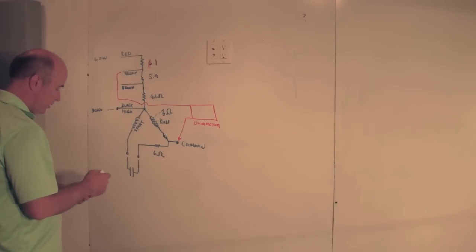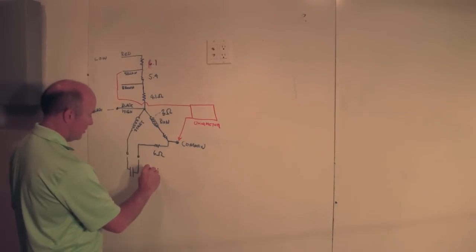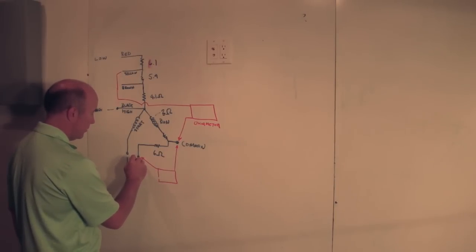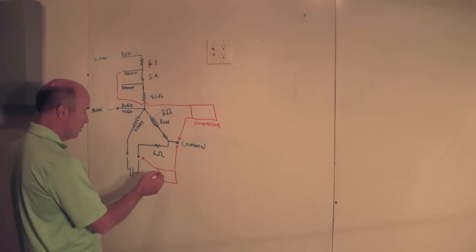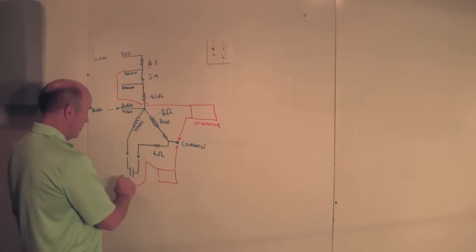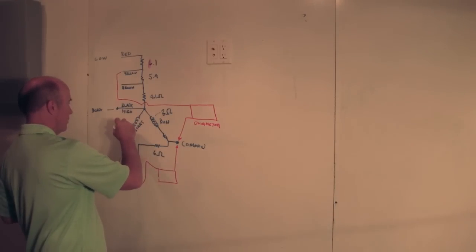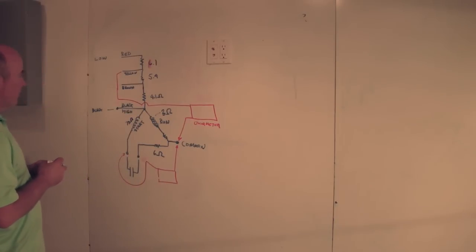So basically what you can do is you can take the ohm meter if you want to figure out which one is which. Put it down here and maybe go from here to here. And you should get a fairly low value, maybe 0 to 6 ohms or very low. If you move that to this side, I think I measured, and that would be going through both of these, but the total was 73 ohms, so maybe this is 70. But you'll get values sort of like that.